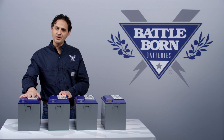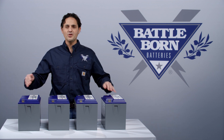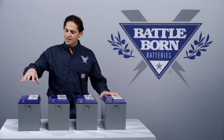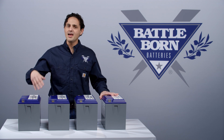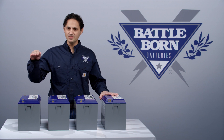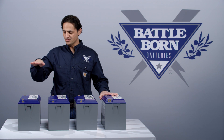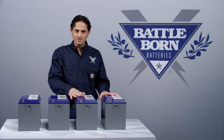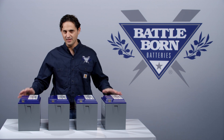For example, if one battery is a little bit higher in terms of state of charge, that means when you get to the top of the charge cycle around 57 volts or so, this battery could exceed its 14.4 volt limit and maybe get closer to 15 volts. In that case, all of the cells would exceed the prescribed threshold internally and they would all start to bleed down, so this battery is actually bleeding down to meet the others, keeping the bank in balance.